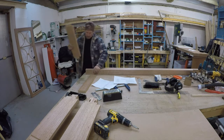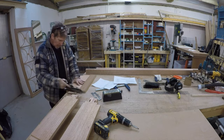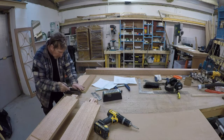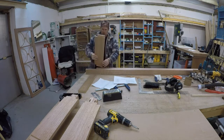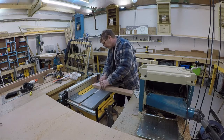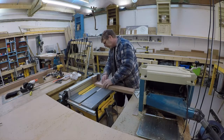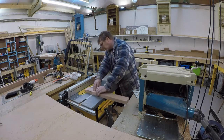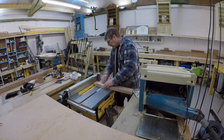And then I'm going to touch up using my rebate plane. I love this plane — it sharpens so well and it's just absolutely beautiful — just to tweak everything up so that it just fits. And then the top rail of the door, I'll do the tenons to that. Just a wee nibble, check it for size, before I go ahead and run the whole lot out.